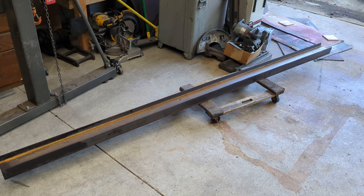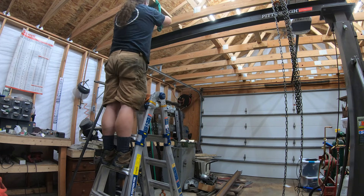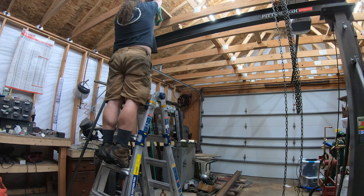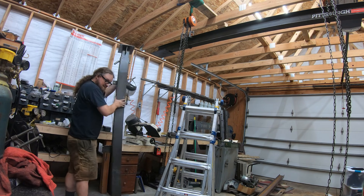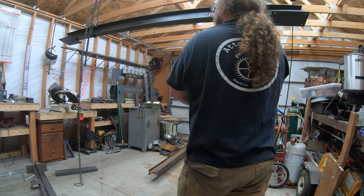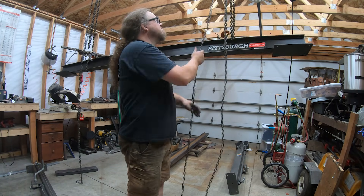With the material on hand, it was time to disassemble the crane. This wouldn't be too hard if I could lift it from above while removing the stanchions, but it's the thing I use to lift things from above. I do have these rafters though, and after messing around with some approaches, I decided that hanging the chain hoists from 2x6s that span two rafters and were firmly clamped in place so they couldn't shift over time would work. And for the first time ever — this was the third time I've disassembled one of these by myself — it actually went pretty smoothly. The beam was held up by the chain hoists, and I was able to remove the tie rods, the struts, and finally the stanchions with ease. I didn't even come close to suffering a back injury this time.